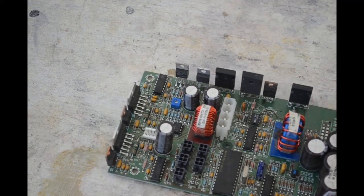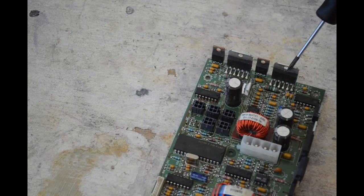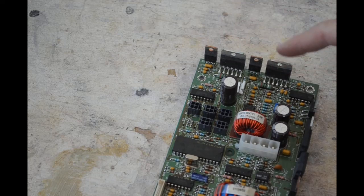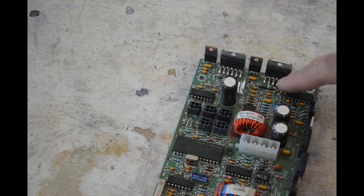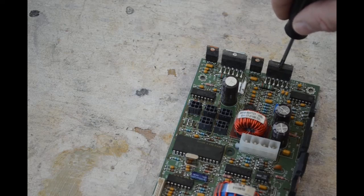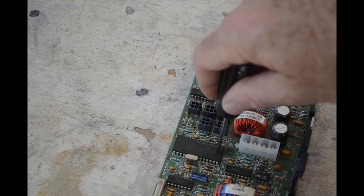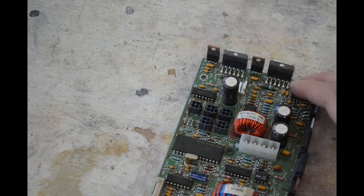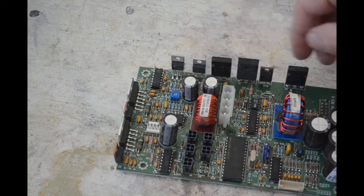And over here, I was talking about transistors and their kin. These are actually power integrated circuits, probably used for running, this was a thermal transfer printer if I remember correctly, so this is probably for driving stepper motors. They're in similar packages to the power transistors, but they have a lot of legs on them. But you can process them just like power transistors. And remember what I said in the beginning, more legs is better because that means more gold wires going to the little die inside. So basically, this is an integrated circuit designed for handling a lot of power. This is an integrated circuit for handling digital signals, but this is an integrated circuit for handling a lot of power. That's how they build them, like these power transistors. Very similar.